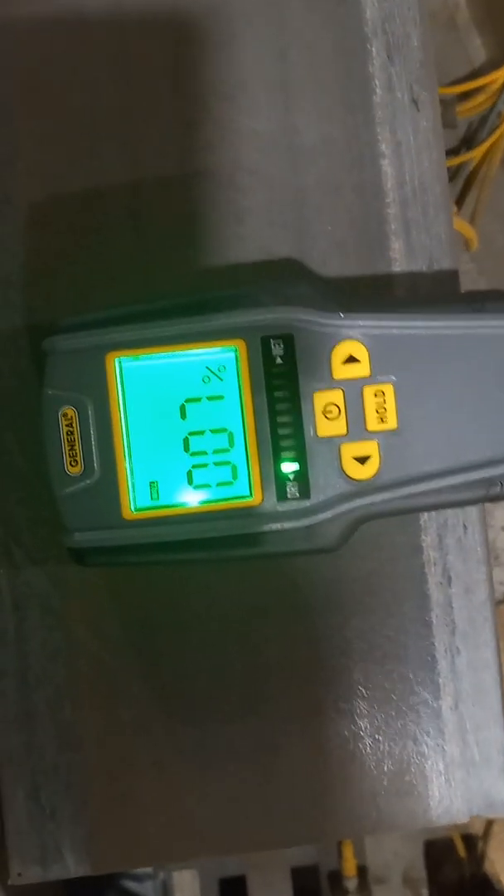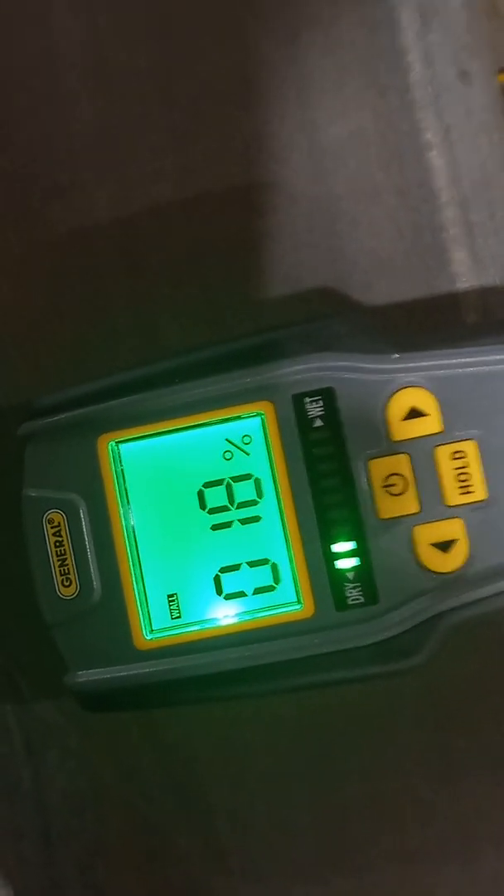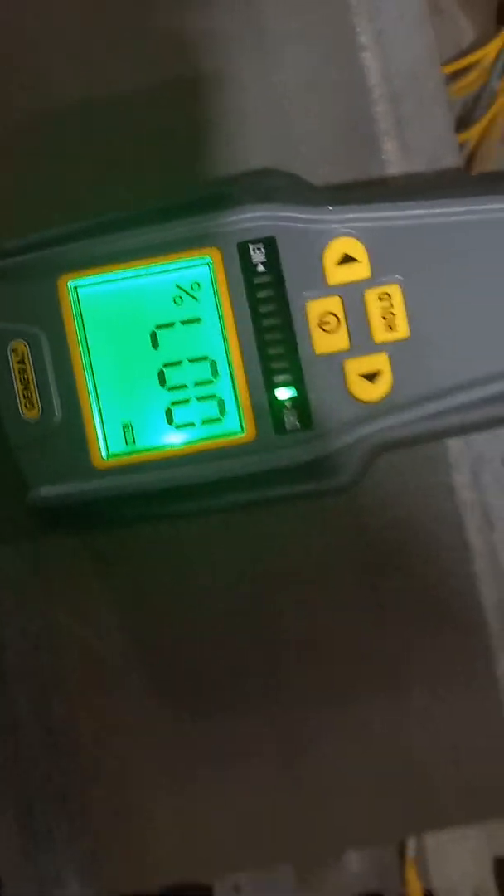These rails are older. We've had them sitting in the shop for a while, it's been humid, but you can see these are at 7%. There are holes, so I'm going to put my hand in there — because I've been looking online and nobody tells you this. I'm moving my hand close, touching the other side of the board: 18%. Moving my hand away: 7%.